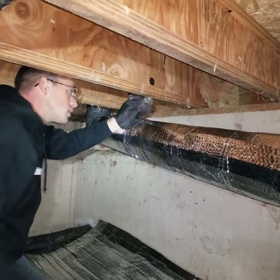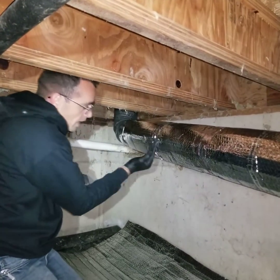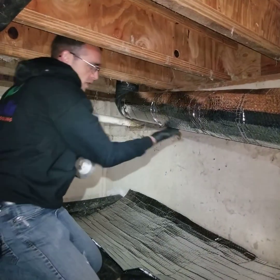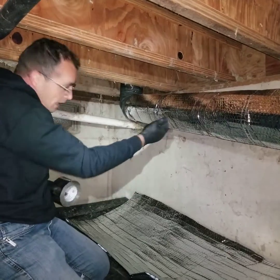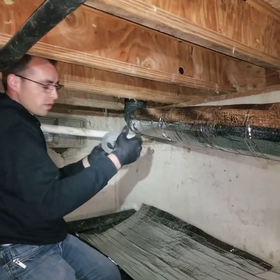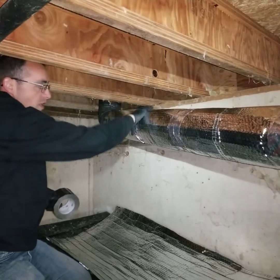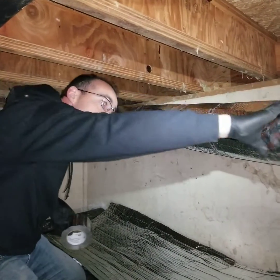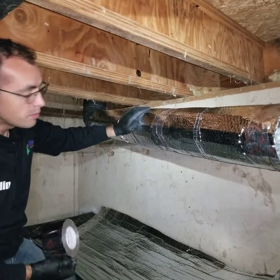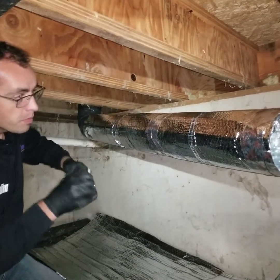You cut it, make sure this lays really well — I kind of got it wrinkled, try to avoid that if you can. I use the back of my fingernails to make sure there are no air gaps, because air gaps will allow dust to get underneath, and a couple of years down the road as this thing gets hotter and colder it's going to crack, dry out, and fall apart. So this circular piece of tape is what's going to give this longevity — 10 or 15 years down the road it's still mounted on here.